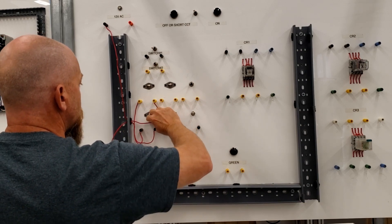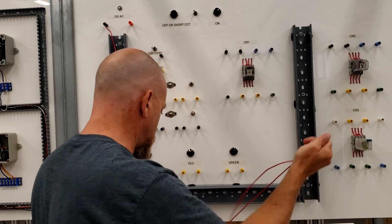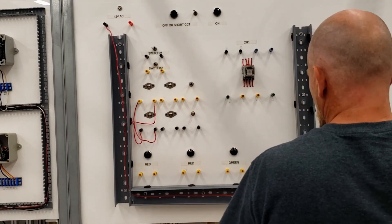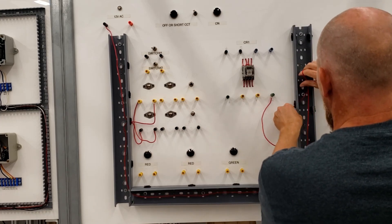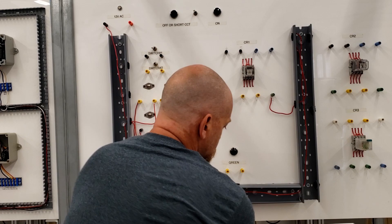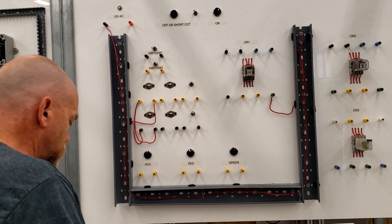Trying to keep your wiring pretty neat — I'm not going to choose a wire that's too short. I'm going to feed number two and I've got some excess wire here; I'll just leave that in the trough. So I'm feeding number two, and then I need a return. I'm going to use a white as the return, and I'm just slowly building up my circuit. So far what I've got is a two-wire control — I don't have the holding contact or anything yet.